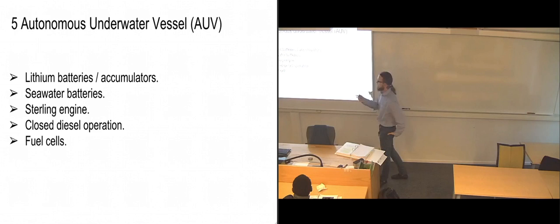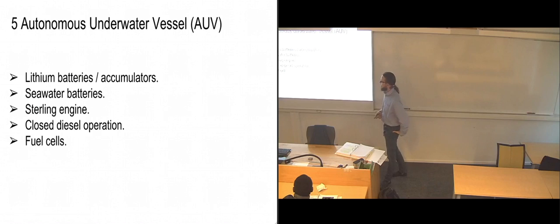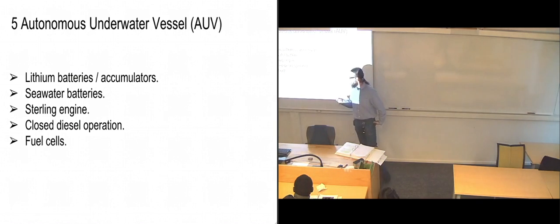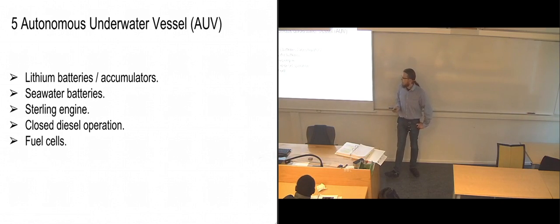So they're really highly efficient with regards to creating energy, and they don't have any waste. They just create clean water when they're finished. But still, bringing the oxygen and the hydrogen gas down can be a bit more tricky. You have to have it under pressure and everything inside the autonomous vehicle, so it's a little bit sketchy, that one also.